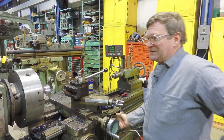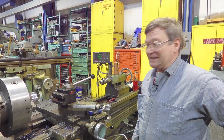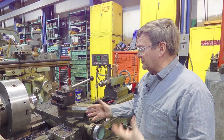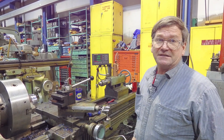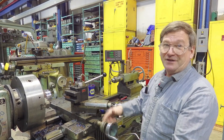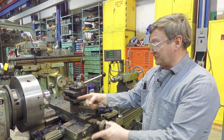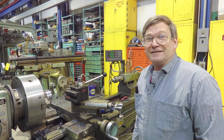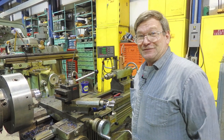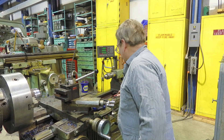You can play with this and come up with something that really works good. If you're doing a CNC, you kind of have to do this a lot of times — that's one of the drawbacks to a CNC, you've got to get the chips broken or controlled. Another way that you can control this: sometimes you just have stringy chips, and even in a CNC you will. So what you'll do is program — or manually — you'll be cutting a little bit and you stop it. You stop it, let it run, stop it. It makes these little chips instead of having a big stringer that's a problem. In a CNC it can really tear up the machine sometimes.